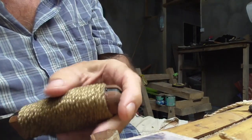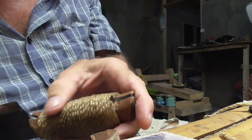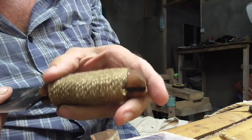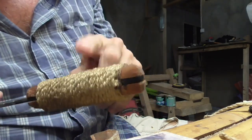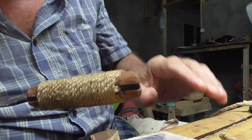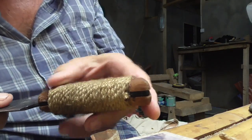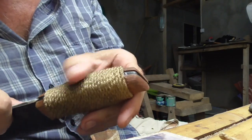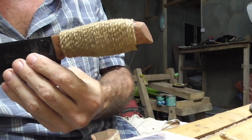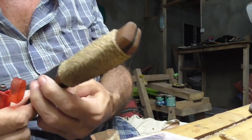Now I'm going to go over it one more time with my thumb and just kind of brush it up, rough it up one more time, whatever you want to call that. This will make a big difference on the way the rubber cement works. Or, another thing you can do, again, you can put super glue on this part here and it'll give it a real nice glossy hard coat, or use clear epoxy on it, which will put an awesome coating on it too, but it's very slippery though. So it's pretty much roughed up again. You see it's not singeing near as much now.